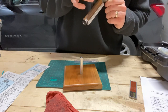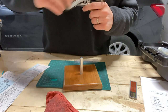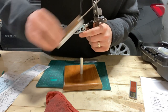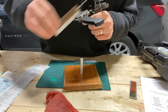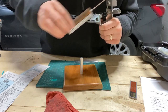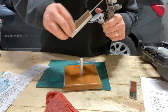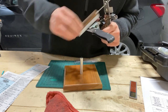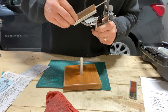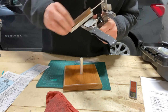So then it's like, okay, well then do a KME sharpening on steels that make sense, like 10V or Maxamet or Rex 45. And yes, I do agree with that. But at the same time, just knocking down that burr, knocking it down. At the same time, those steels are much harder, so they take longer because of that. And like Maxamet and Rex 45, those are steels that are fun to sharpen freehand. They actually come up nice and aren't temperamental with the burr and everything. So I don't want to sharpen those in the KME. So the KME doesn't get used a lot for me because it just takes a long time, and the steels that I feel would be worth doing it for are ones I like to freehand anyways. So it just doesn't get used much.